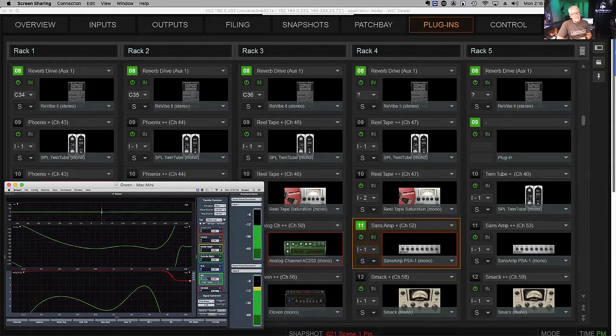And as you can tell, crazy magnitude trace, crazy phase trace, and really all that kind of flutter that you see up there above 8K is because there's nothing above 8K coming out of the unit. That's why it's so unstable up there. But a lot of phase shift going on in this box and a lot of equalization, but there's also a lot of power in it.